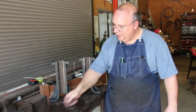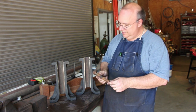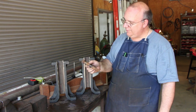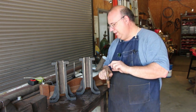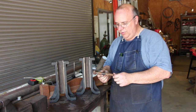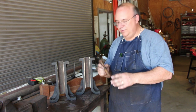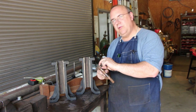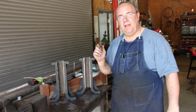Before we can get these stanchions mounted on the machine though, we've got the issue of some bolts. This is a three-quarter-inch bolt, about six inches long, with an inch-and-a-quarter hex that's about three-quarter inch high. I can't find a bolt to match this — I can get one the right length and size but it has a very narrow head, and from taking these off you need that extra height on the head just to get a wrench in there. So I've got some inch-and-a-quarter hex stock and we're going to make some new bolts. These are pretty much toast anyway — heads were messed up, bottoms were messed up, I had to drill one out because it was so rusted. We're going to make four bolts and four nuts. I want a thicker nut — a three-quarter-inch-thick nut — and we'll do that on the lathe.